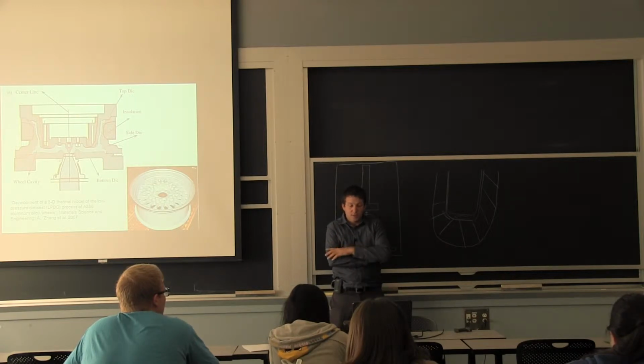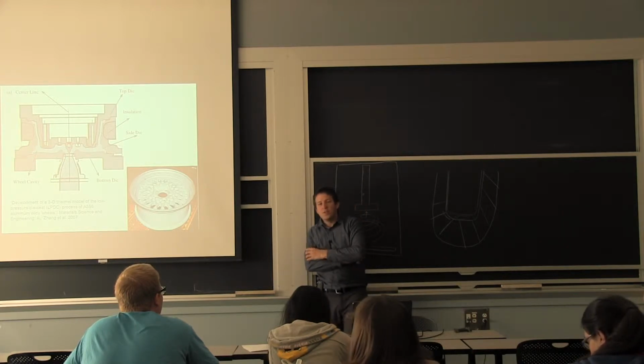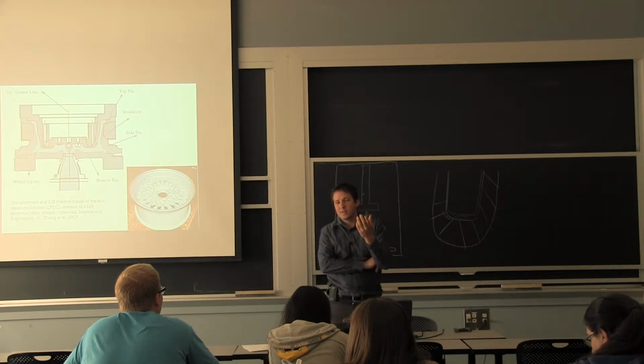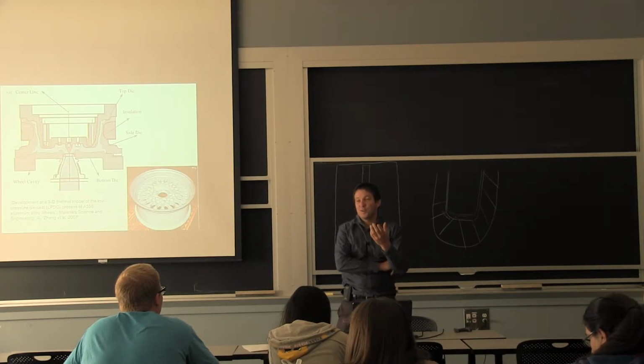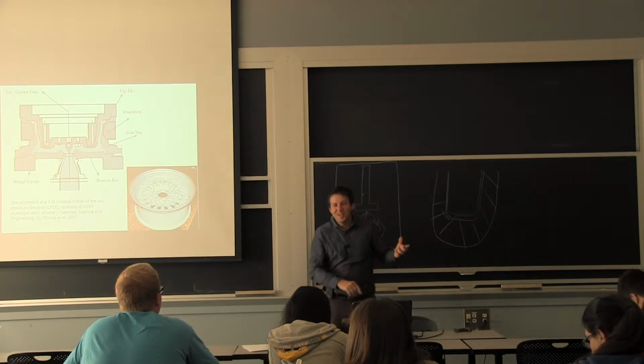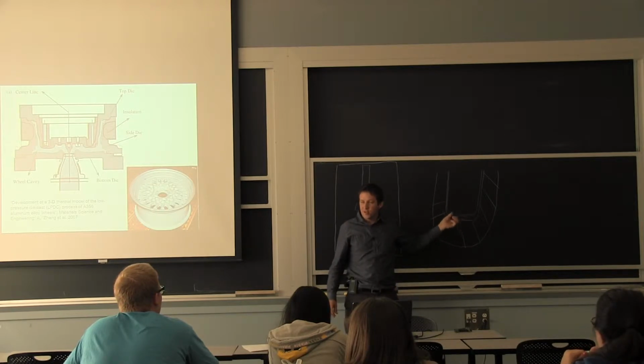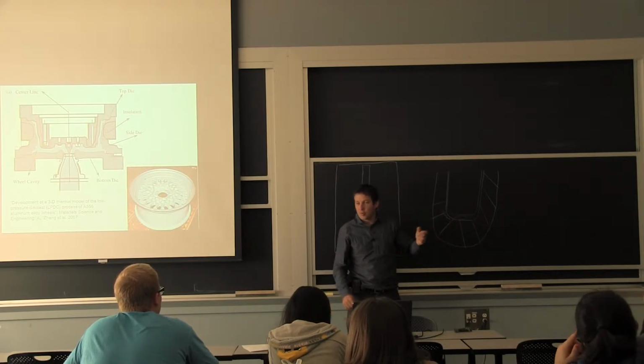The reason I mention it is we had a few projects with aluminum wheels with fatigue cracks. And if you take the wheel and do a very detailed computer analysis of it, you'll find the stresses are very low, and there shouldn't be any problem. So you need to think about these residual stresses to explain why cracks can start improperly.